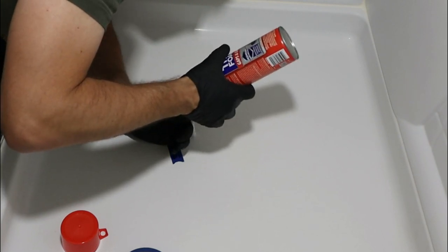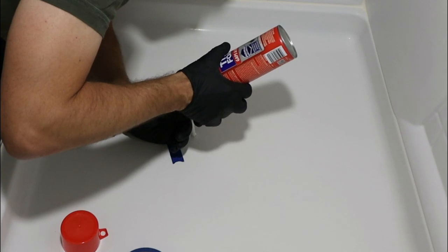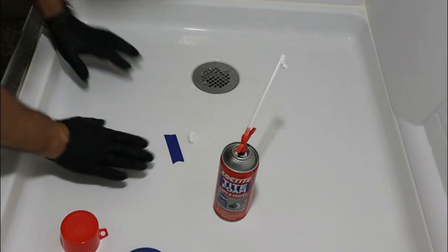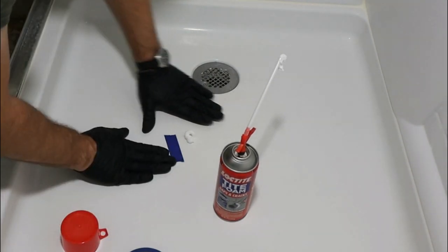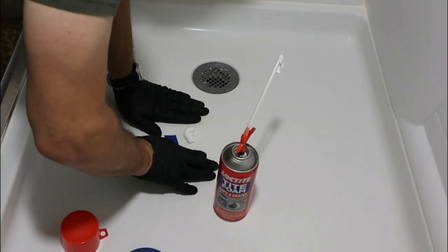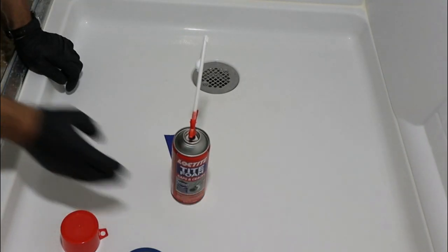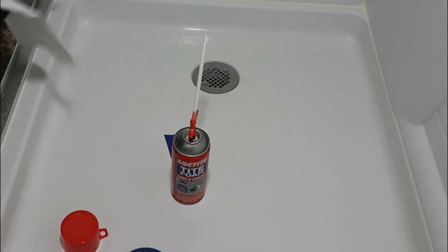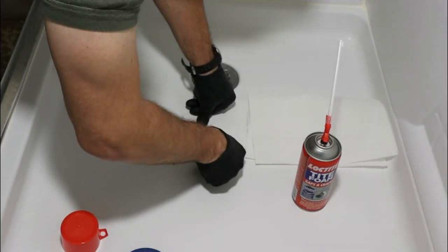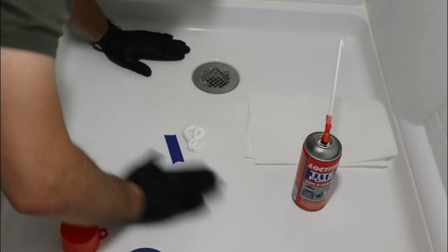Oh, we might want to stop it now because the shower tub is lifting. Cool thing is, the stuff sticks like crazy, but we can just cut it off afterwards and scrape it off with a plastic scraper. Yeah, now we have a little hump here in the middle. We might want to shape this back, just a little bit to avoid too much rise here in the middle.